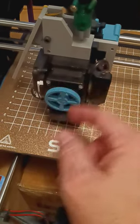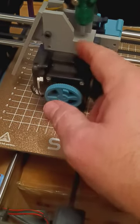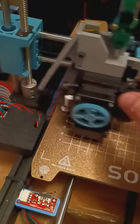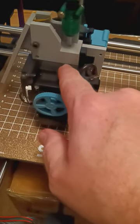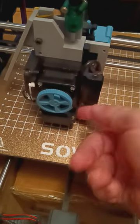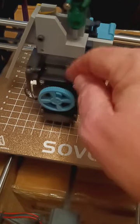Basically, when you want to change filament, you're going to back this out a little bit — not too far, maybe 10-12mm. You then home the X axis, and when you home the X axis, that slices the filament off. Then you go ahead and push that remnant back down into the hot end — not all the way so that it dribbles out, but maybe 5 or 6mm — just to make sure you have a clear path.